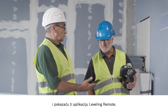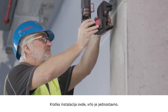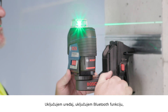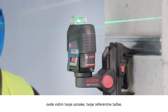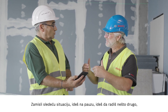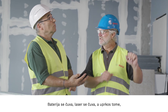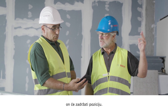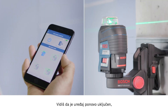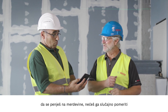Take my smartphone and I'll show you the leveling remote app. You just need a quick installation which is really easy. Then I activate the tool and the Bluetooth function and I can see your markings and reference points here. And now you can see the response. The connection is established. Now imagine you go on a break or start on another job and don't need the laser anymore. Just put it on standby. It preserves the battery and the laser but keeps the position. When you come back you can get right back to work. You will see that the tool is reactivated, but the advantage is that you don't need to go back up the ladder and you won't accidentally move the tool again. You're on the safe side.